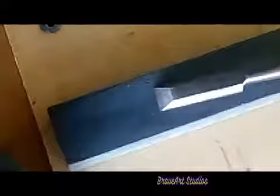Okay, you use the whole of the stone. There's two sides. You use the darker side first and then the lighter side for the second run. You put oil on the stone and you use the whole face of the stone. This is backwards and forwards until it gets done.